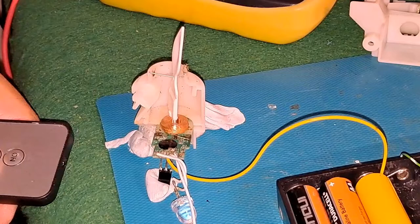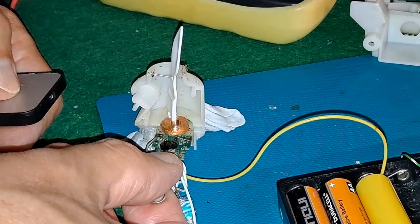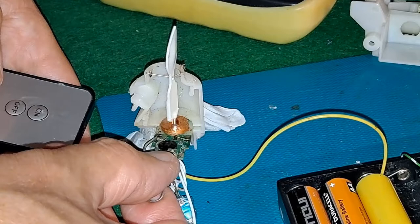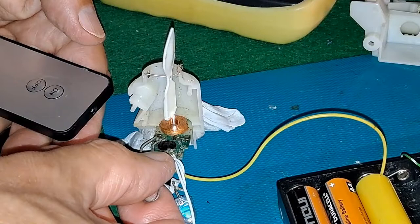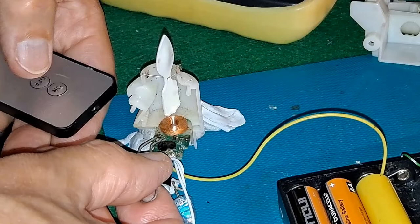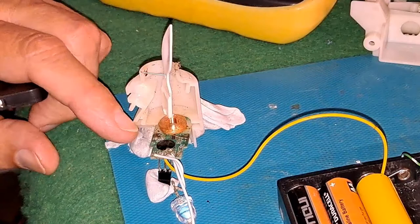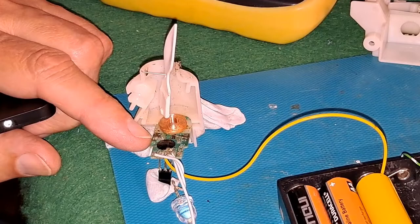See if we can demonstrate this - holding the probe on either side of the resistor, alternating between on and off. So either that little resistor is faulty, or it's got corrosion under it and it's not making contact.